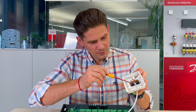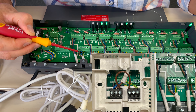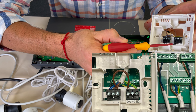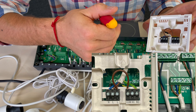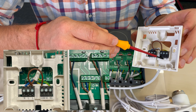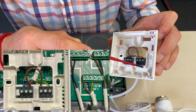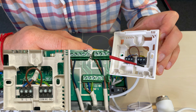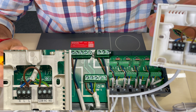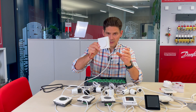This thermostat needs 230V mains supply — here we have neutral and live cables, brown and blue, connected to live and to neutral. The relay is separated and free of voltage, so you can even control a 24V actuator with it. Whatever voltage you supply to the COM port, you will have that same voltage on the NC or NO output. Here there is a bridge from live to COM port, and from NO I go to the load port — that is how I tell the wiring center I need heating or not. This thermostat is suitable only for heating, wall connection.